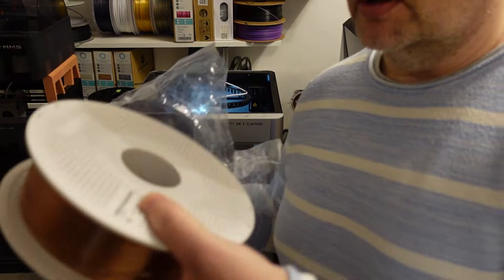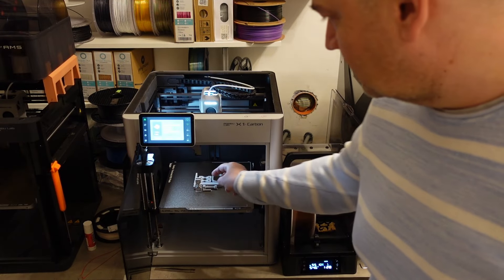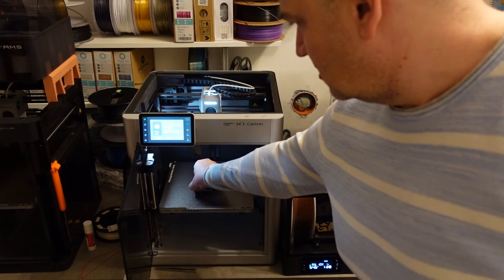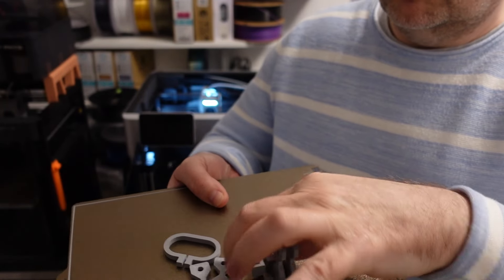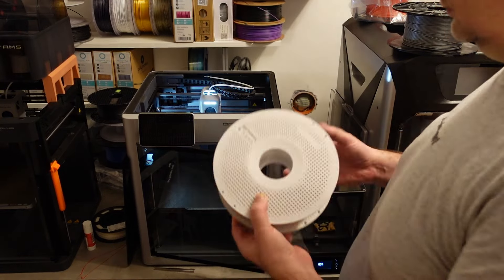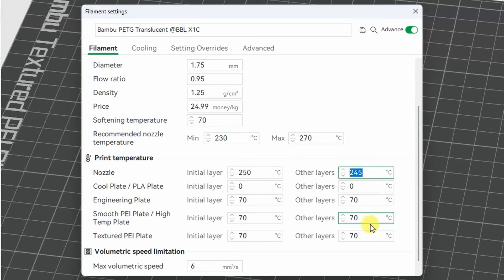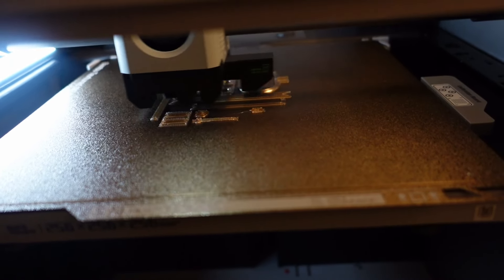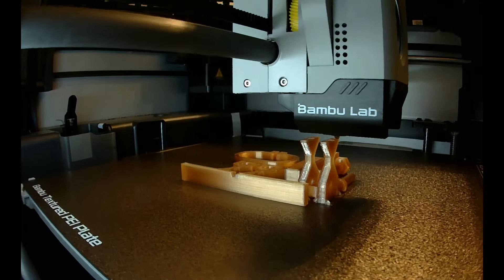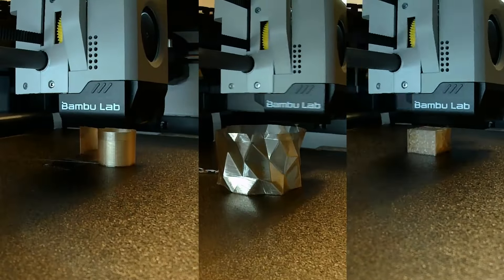While the printing is not finished I am preparing the translucent and placing it in the filament dryer. For translucent in Bambu Studio the print temperature is 245 degrees Celsius, 70 on the texture bed, and only 6 cubic millimeters per second is the max flow. The first few layers look very transparent to me. Here is one short timelapse video of the printing, and I already mentioned that I will need a few more test prints from this material.